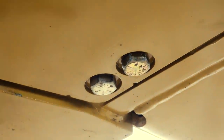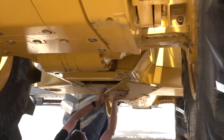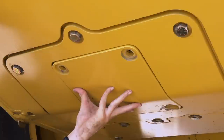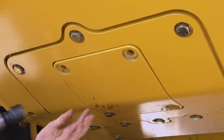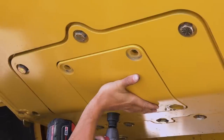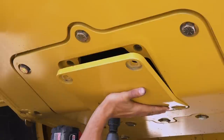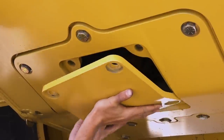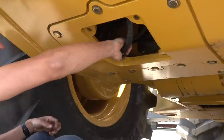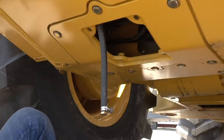All the flat doors on the front chassis now include a pivot bolt, so that allows you to swing the door out of the way to do access and service into the machine and allows you to clean the machine out easily without having to drop those big heavy doors down. The front angle door has tabs built into it to prevent that door from dropping down, and in the center of it there's a smaller access door for easy access to the engine oil drain. The hydraulic tank drain has been relocated so you can now access it through that small door, and the coolant drain is also conveniently located there as well.